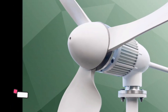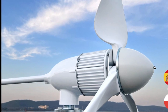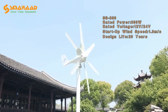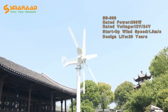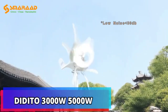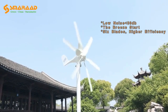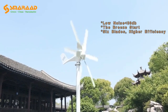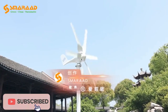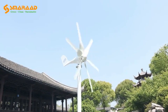Not bad for a homemade wind power generator. There aren't only pros to the design, however. While VAWTs may be cheaper, more mobile, and more resistant to wear and tear, there are some design features that prevent the generators from functioning as well as horizontal axis turbines at harvesting energy. The blades don't produce torque at the same time, with some blades simply being pushed along, producing more drag and limiting the efficiency of the entire system. In addition, higher wind speeds are typically found at higher altitudes, so VAWTs will perform better if installed on a towering structure.